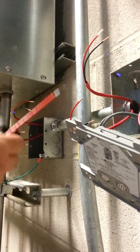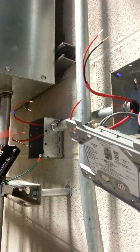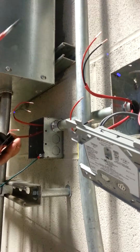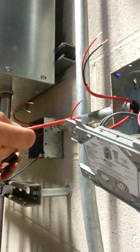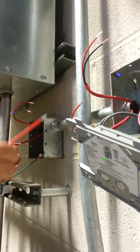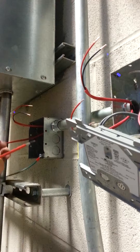So I've got an unprotected side and a protected side. The protected side is going to be wired back to the module. My unprotected side is going to be hooked to these wires which go out to the device out there in the field. So we're trying to protect the module.